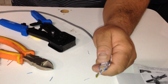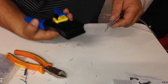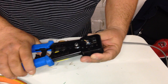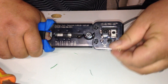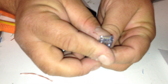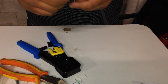This is a straight-through cable, meaning pins one through eight are the exact same on one side as the other. Here's the best part: once you put the connector through the tool, the tool will actually lock itself as it's crimping. As it's crimping, it's cutting flush right to the connector — a clean cut every single time. Perfect connector — you can pull on that and the case will pull out before anything else does.